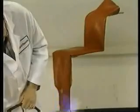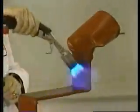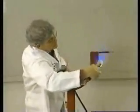BPTM and BBIT tubings are pre-engineered to give the appropriate amount of insulation for the indicated voltage. BPTM tubing is rated to 15 and 25 kV. BBIT tubing is rated to 35 kV. Both tubings are non-tracking and are suited for severe operational and environmental conditions as found in coastal areas. They are ideal for retrofitting old insulation to upgrade your electrical system's performance and can also help to significantly reduce clearance distances.